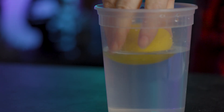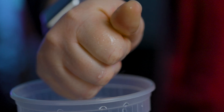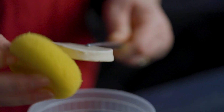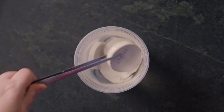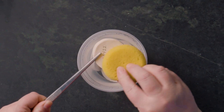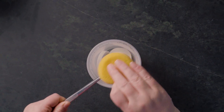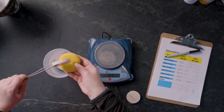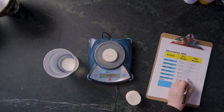After the sample is thoroughly cooled, take your sponge, soak it with water, and then wring it out completely. You want the sponge to be damp but not wet. Then wipe off the sample as thoroughly as you can, because you don't want any water sticking to the surface that hasn't been absorbed by the clay. This is why the standard is 0.5% instead of 0% — because you can never get rid of all the water sticking to the outside. There's always going to be a little bit, so the standard has a little bit of wiggle room. After you've wiped it down, put the sample back on the scale, weigh it, and record the weight.